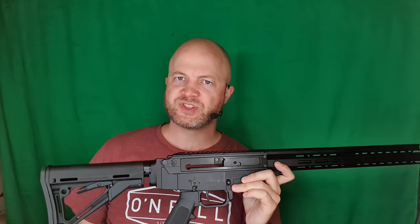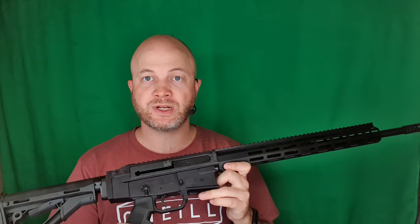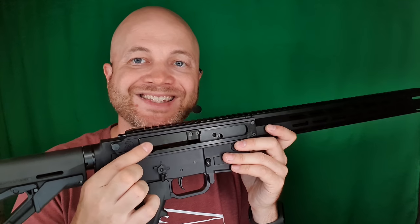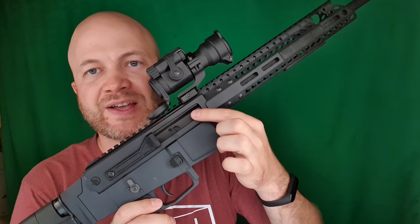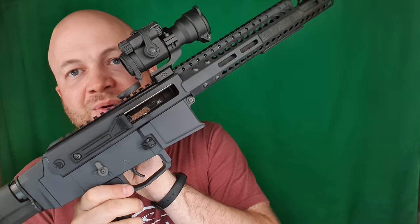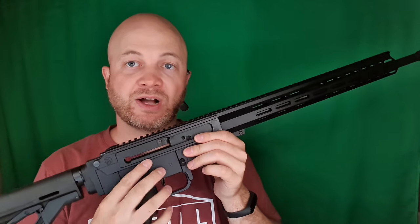The WSMCR is very similar to the WK-180C. Wolverine Supplies was in on designing and building that originally with Kodiak, whereas this one's made with Spectre. They have chosen to change a few things on this rifle. These side inserts here are steel, and there is an insert being held on by screws as well, so we've got steel on both sides. With the original 180, those sides were just aluminum, and some users reported it was starting to wear away either the charging handle or other parts.